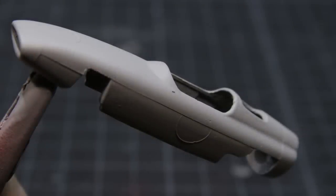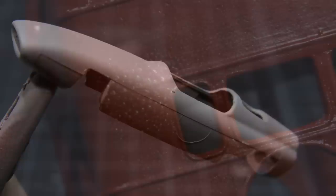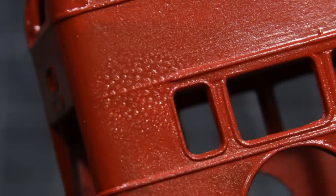And then I'm ready for paint is that 52 BRM Racer. Yeah, it's going to be a really simple restore, but I think once it's done, it's going to look super nice. And then I was painting the 74 Fleetline again, and while I was painting it, I saw this start to develop by the back of the toy. And so I just stopped painting immediately. I'm assuming that I have some type of a contaminant on the surface of the casting itself. So if I'm lucky, I can save this, and I'll just wet sand it and clean it really good, and then I can just start painting on it again.